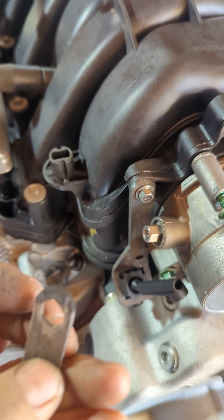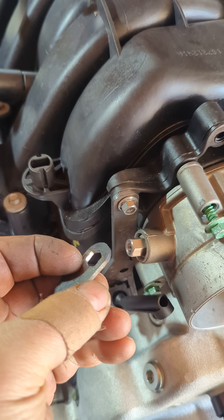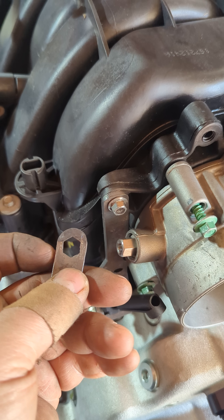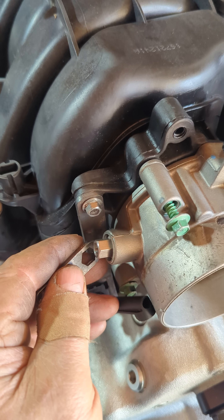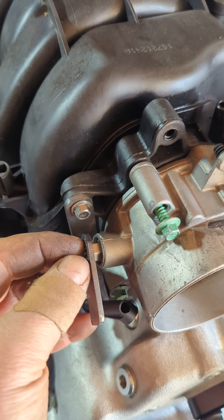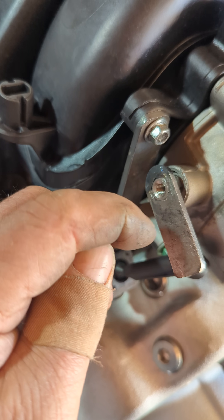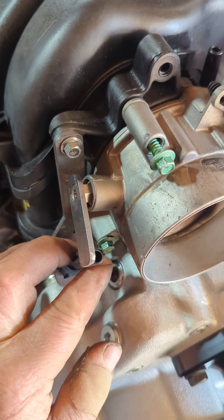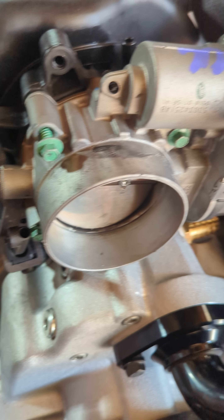I needed an arm, so I actually took a piece of steel and drilled a hole in it and then pressed a 10 millimeter half-inch drive socket through it on my press and cut a 10 millimeter hole out and it fits on there nicely. I will weld a washer on here and put a bolt through it and it will hold on really well. That pretty much concludes the arm here for the standoff.